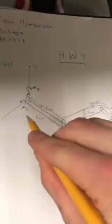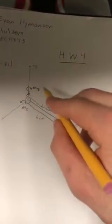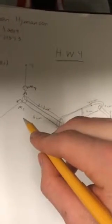Because they're located at the end point, we know that the critical stress is located at A, and it's going to create two moments: one My, which is negative, and then Mz, which is positive. So first we're going to calculate My and Mz — starting with My.